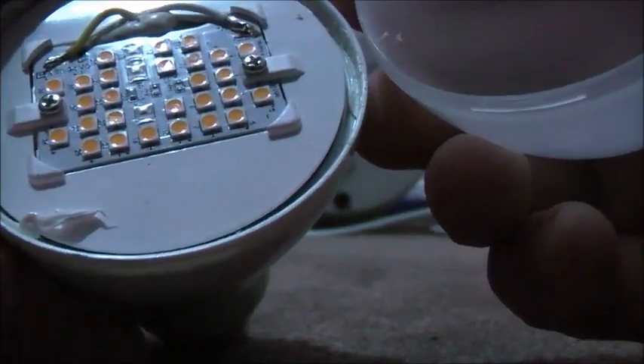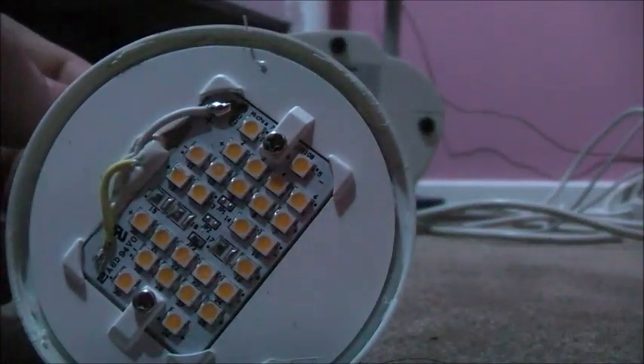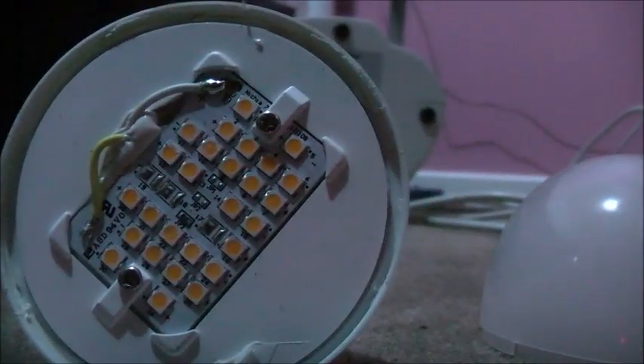Manufactured in the 23rd week of 2013. Since these are white LEDs, I want to try my multimeter diode test function on them — let's see if they light up or not.